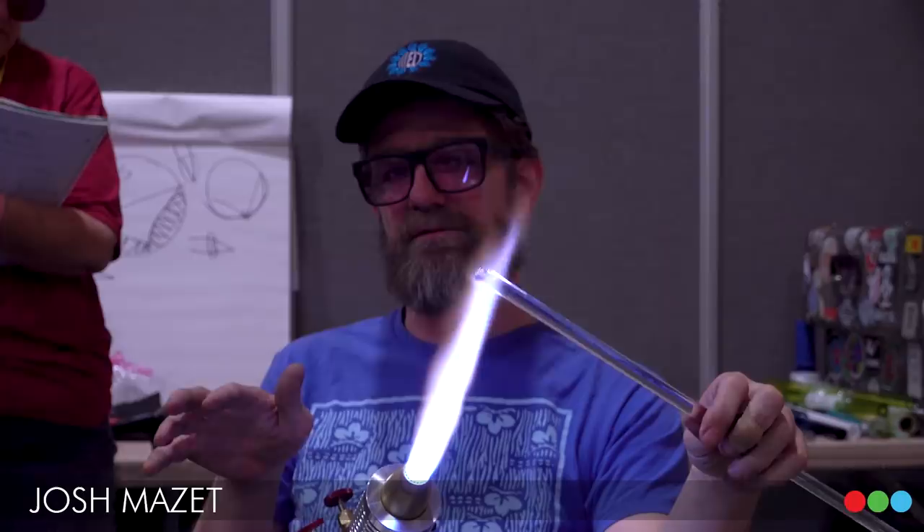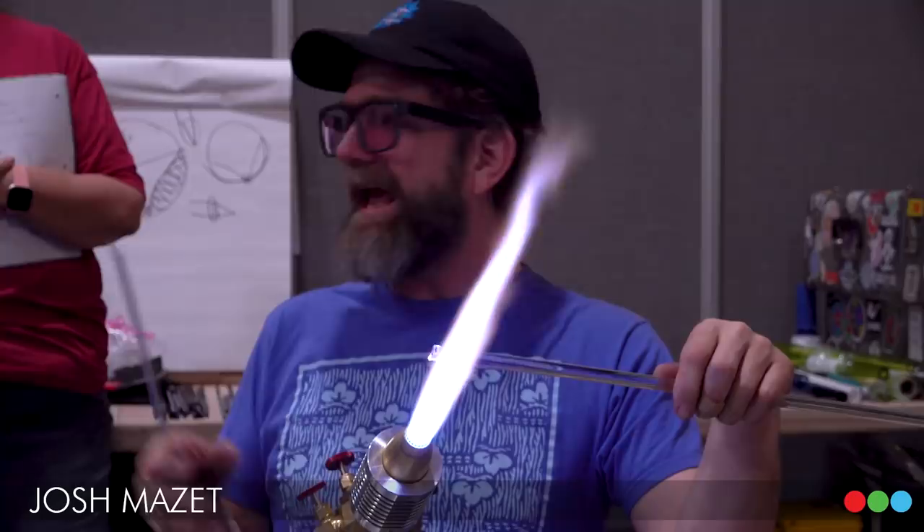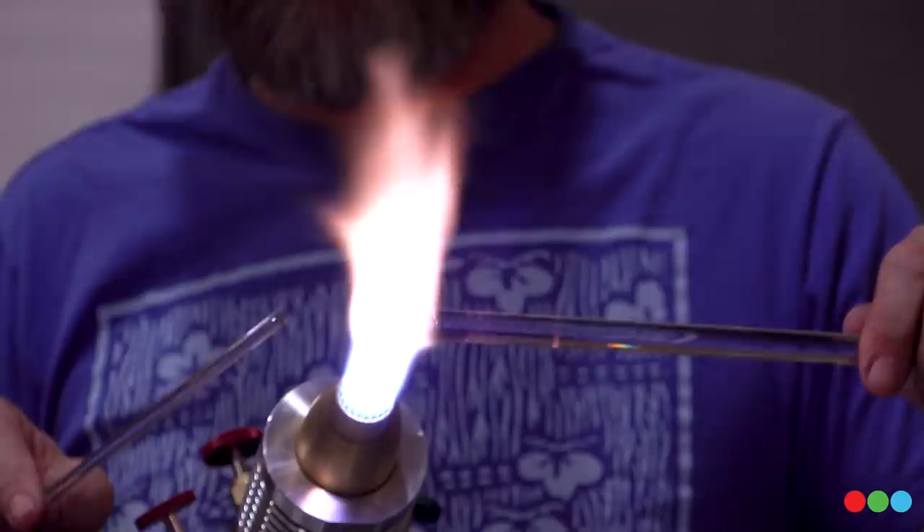The key to cleaning this off: when I hand you your 11mm or 12mm rod, look at it and decide which is the ugliest end, and make that the side you clean off. When we go to clean off, we want to do this without elongating the piece. Often in this class I will just make you start with that cut-off piece, because at least I know you didn't go to clean it off and pull a point or something like that.